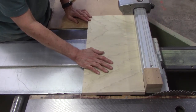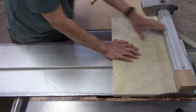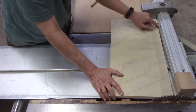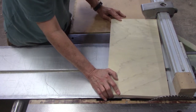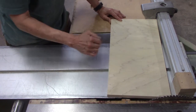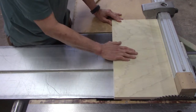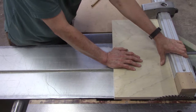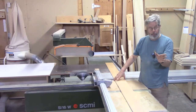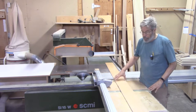If you're making a cut using this stop block, which sets your length for you, and if it starts to move in the cut, the line from here to the corner is longer than this line — therefore it's putting pressure against the blade. That blade is running at 180 miles an hour with 10 horsepower of energy behind it. With a little bit of pressure, it takes over and throws the piece. It'll spoil your cut. The bump and cut works great when you have a long piece and want to cut short pieces off of it, because you can use that length for control and it doesn't get trapped.